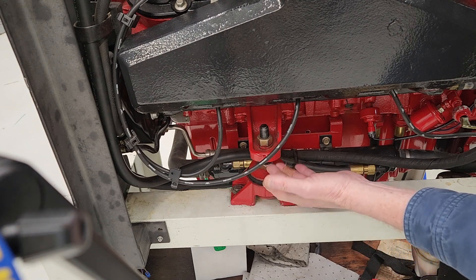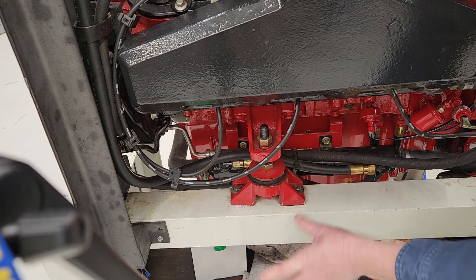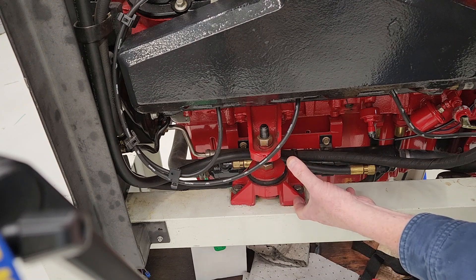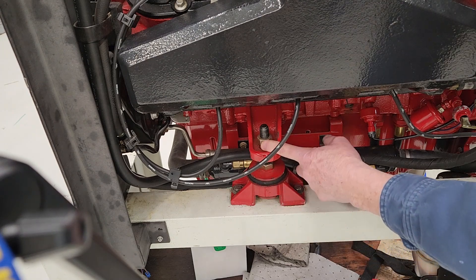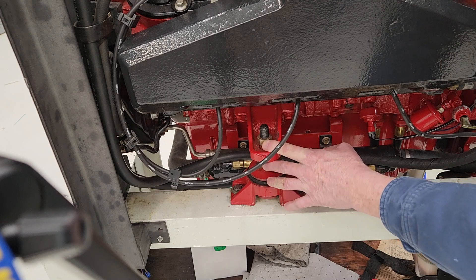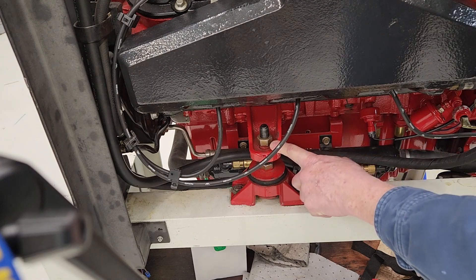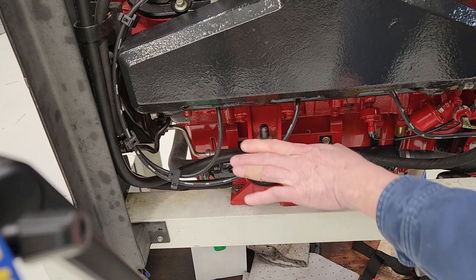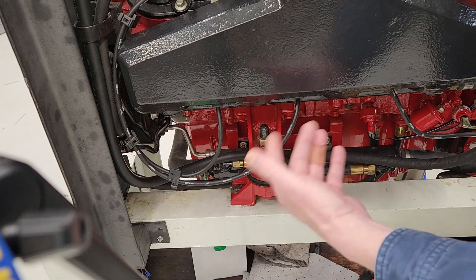When we do engine alignment, we do it on both sides equally — keeping the distance between the motor mount and the top of the stringer the same on the port side as on the starboard side. That raises or lowers the engine, which changes the position of the engine coupler relative to the transom assembly and the gimbal bearing. There's a torque spec in the book for these nuts, so look that up and torque each side equally so the nut doesn't back off. I've seen people fail to tighten that nut, have it back off, and the motor mount bolt vibrates down — then the engine is cockeyed, facing down on one side, which throws the coupler out of alignment with the transom assembly. That's where the failure occurs.